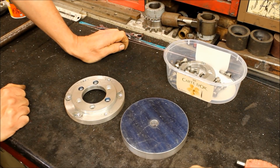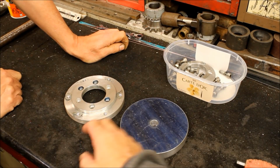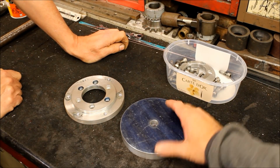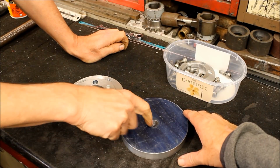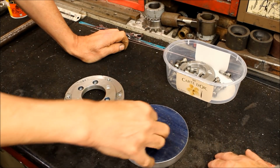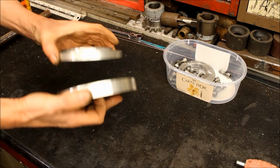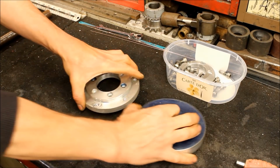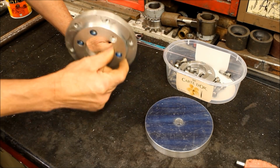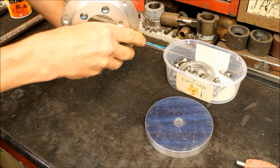And now here we are on the workbench, and there's my first original disc mount. And here's the one you've started. You said that's dotted out as a big square. I've had to drill it into a circle. Into, well, more or less a circle. I've put a mandrel, a bolt through it with a stub on it, and then I've got it now to the same diameter. So now I can put the external jaws in and start machining the recess. It's actually been bored in at the back to come over the hub a bit.